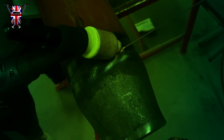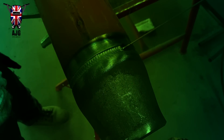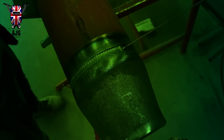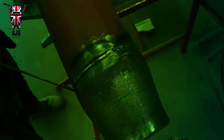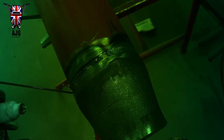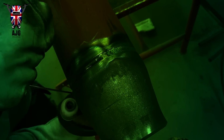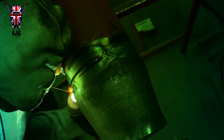My post flow, I usually have it on for 5 or 6 seconds depending on what I'm doing. I know some people that have it turned on for like 10-20 seconds, but doing stuff like this, you don't really need it. I almost forgot to say, when you're filling up your hot pass, usually I just use a 3.2 wire. It just fills it up in one go.